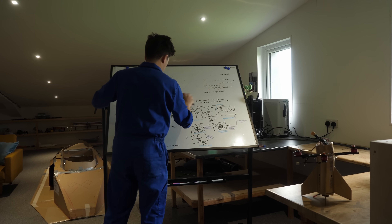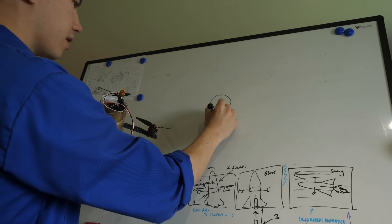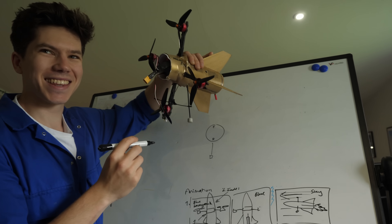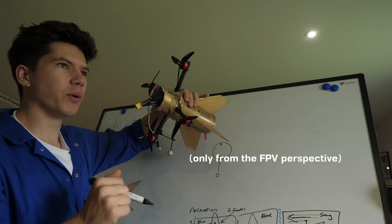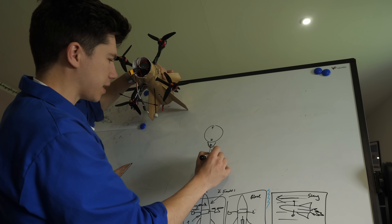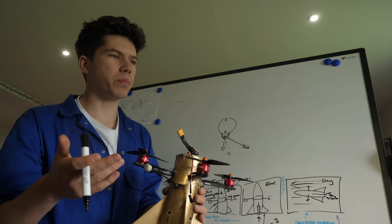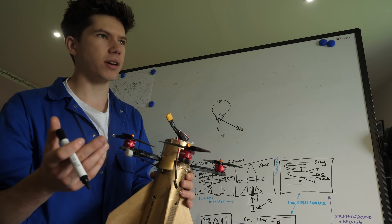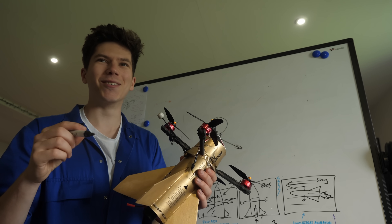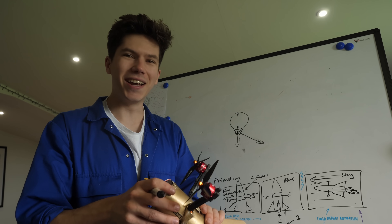Emma and I headed back to base to make a cup of tea, get out the whiteboard and figure out what went wrong. I had a feeling it had something to do with the camera. The camera was on the rear of the drone instead of the front — so left and right were wrong, and forward and backwards were wrong as well. I had basically inversed the controls by having the camera on the back of the drone. Flying normally was absolutely fine, but when I put the goggles on everything was the wrong way around. I guess we should just rebuild this with the camera on the right side.